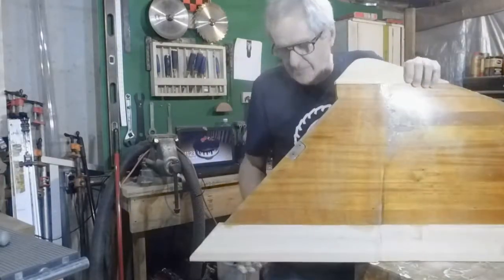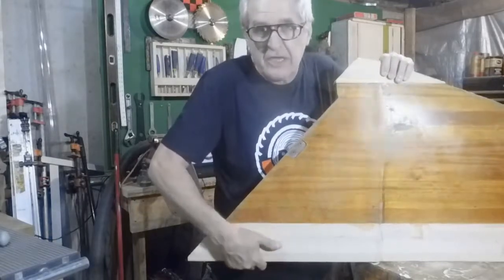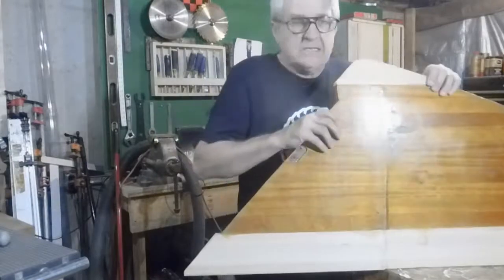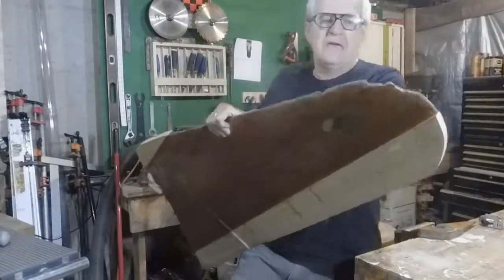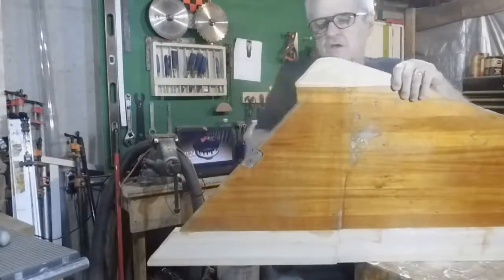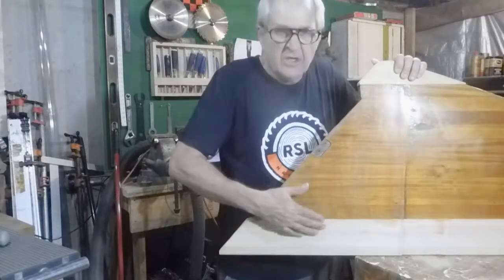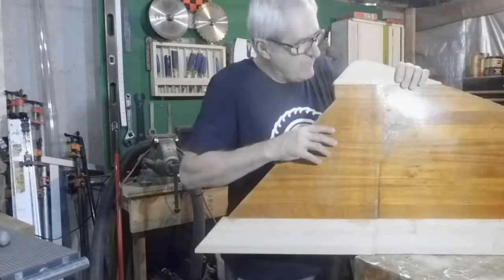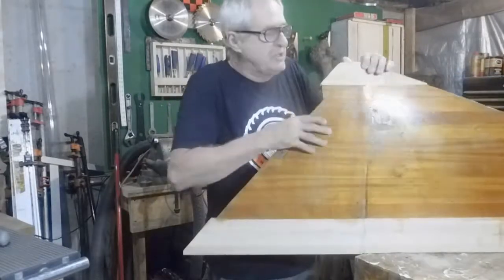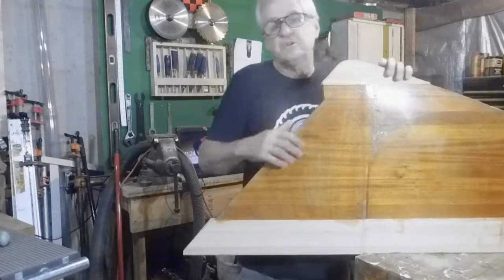So far I've got the boards glued together on my center board and I've come to the conclusion that this is mahogany. I put red cedar on the two sides — I don't think that'll be a problem. What I'm going to do now is fair it out, sand it out, and try to get it looking nice. It's got some really rough edges on this end here, there's a little bit of an open seam I can't do much about. I'll round this off, fair this off, and come back when I'm done. I got one done, I still have the other one to do — I'm going to take a plane, try to plane them semi-flush, run them on the sander, and clean up some of these edges.